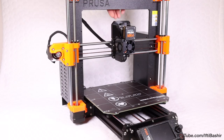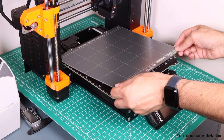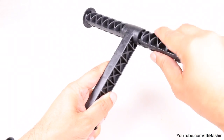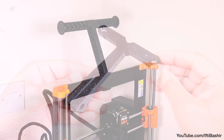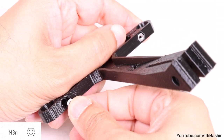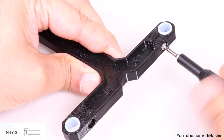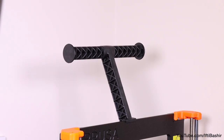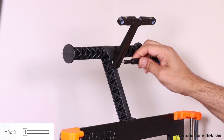And that's it — the printer is now fully built and complete. So off mine goes to its new home, where we can snap on a steel sheet, which is magnetic and lines up with the two pins at the rear of the heat bed, and then construct the spool holder by simply holding the central part and pushing in and twisting both handles onto each side a quarter turn. This can then clip into the middle on the top frame, making sure the spool holder is inclined towards the back of the printer. New with the Mk4 is a filament guide, which can also be installed at this point. Prepare by inserting two M3 nuts into the marked openings on the bottom side, then insert the two included PTFE tubes into the marked openings, and fix the tubes in place with two M3 by 10 screws from the opposite side. Finally, insert the third M3 nut into the opening on the bottom side, before attaching the filament guide onto the spool holder — it should click in between the top two ribs pointing upwards. Fix the guide in place using a single M3 by 18 screw.